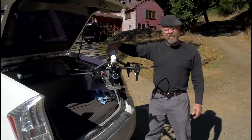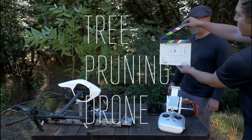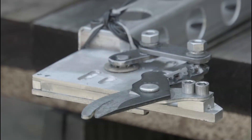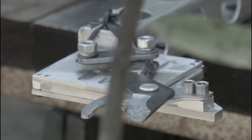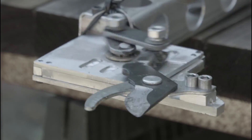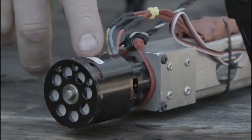This is a tree-pruning drone that I've set up. I first tried putting a circular saw on it, and I thought it was funny — for obvious reasons, it's probably a bad idea. I've modified this drone to take a conventional pruning shear. I took the handles off of it, added a little linkage to a worm drive gear reduction drive shaft that goes all the way back to the motor on the back end.